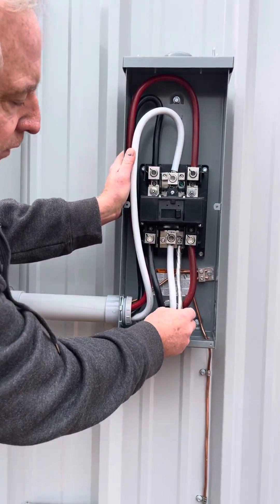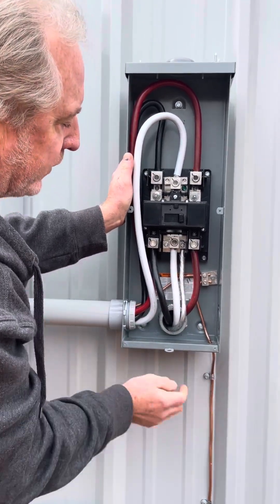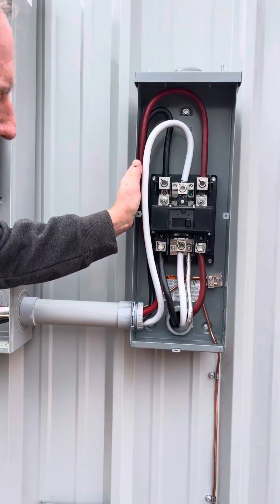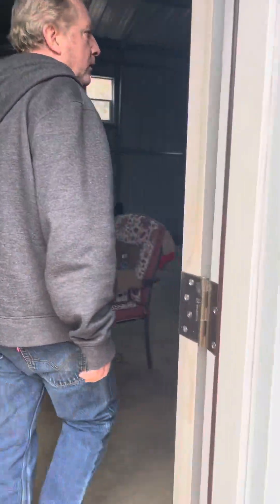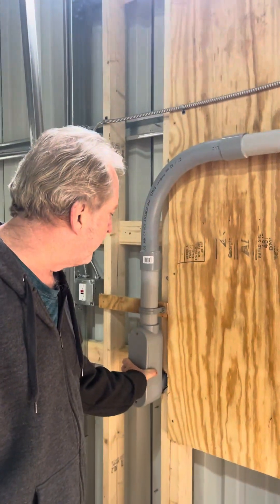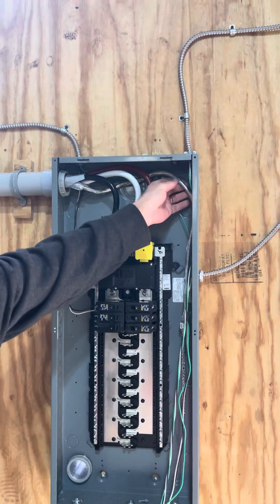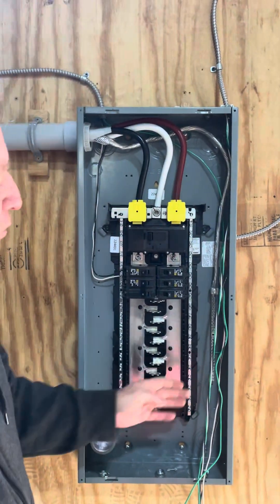On this disconnect box I have a panel behind it, so there is a ground wire that runs from this neutral to the box inside. The wiring comes from the disconnect outside, up and over to this panel, which is a 200 amp panel. The grounded wire comes through here and onto this ground bus, which I had to purchase separately.